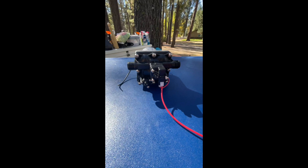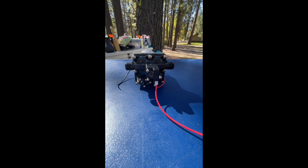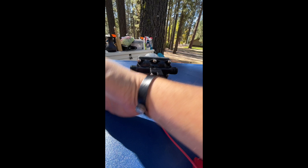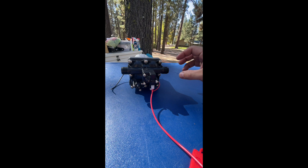Why does that matter? So if you're connected to your city water — city water is connected in this area — and you come in and suddenly your fresh water tank is getting filled up, it's because this little check valve is not closing and water is going backwards through the pump and into your tank. So the idea of the check valve is just to close this whole area off completely from your city water, from your faucets, and everything else. That's why the check valve is very important.